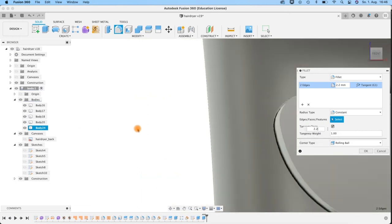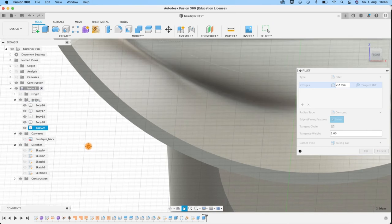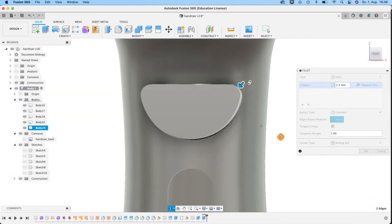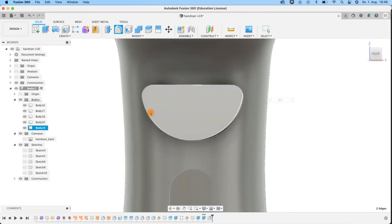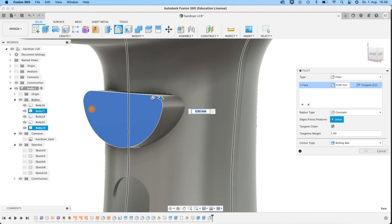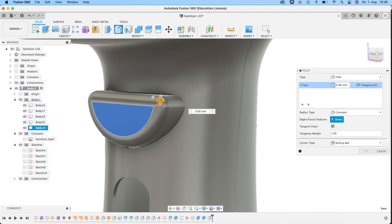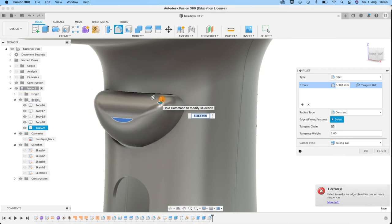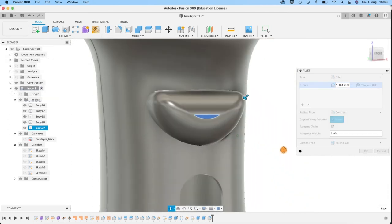Going into the right sketch again — let's do a new sketch and do a projection because we need a little bit of guidance. Project and select the body, hit OK. We need some helping lines to create this arc perfectly. Start a line here — perpendicular and also horizontal — take it eight millimeters to the inside. Make it a construction line. Also here at the bottom a horizontal construction line. Create a three-point arc in between — it snaps nicely so we have a tangent midpoint here.